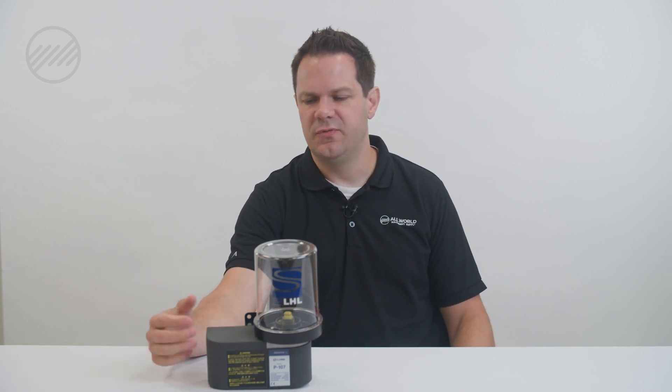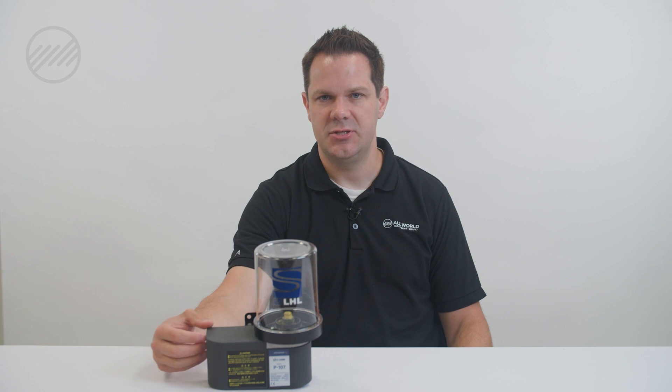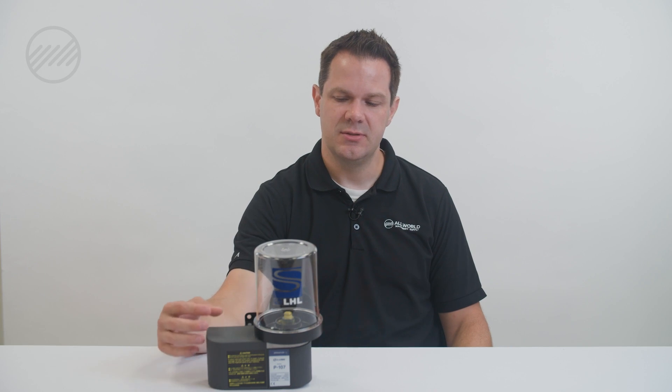The third thing to look for is the voltage of your pump. There are lots of combinations — 100 volt and 200 volt are very common — but it's important to know which. There are also brands that are dual voltage. So if you're using a dual voltage motor, you need to know which voltage it's using in order to specify a new unit.